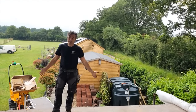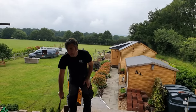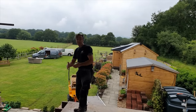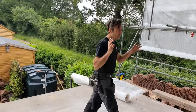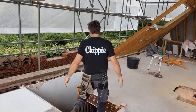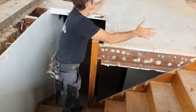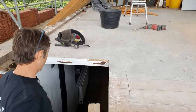The roof is out as much as I need at the moment, and now you can see these were the floor panels here. There's the old wall plate. Everything used here was reclaimed. It wasn't up to much. The old brick walls were then lined around the inside with a cavity. Even where they've cut this staircase in here, everything was bad. The headrooms were awful. They've literally chopped the joists off. So the joists are coming through. This one here, they've cut it off and just spiked it in the end of the newel post. So that was effectively holding this bit of floor over here. This joist here, they've just cut it out for the headroom.